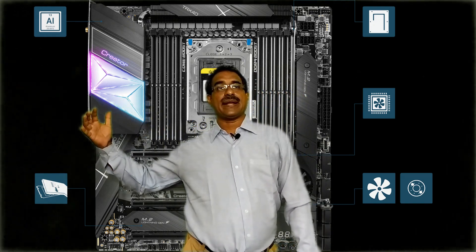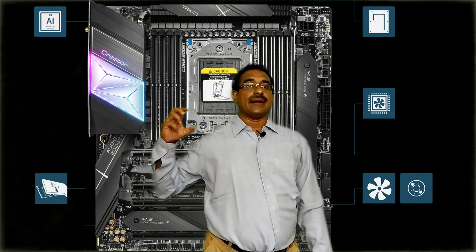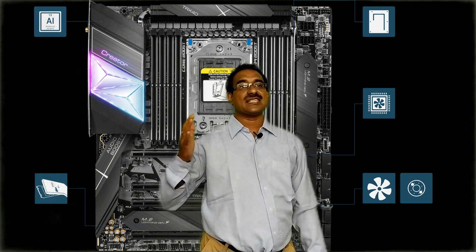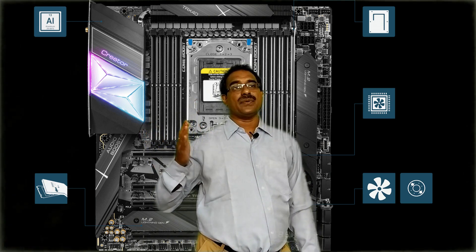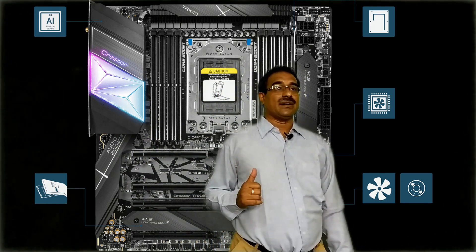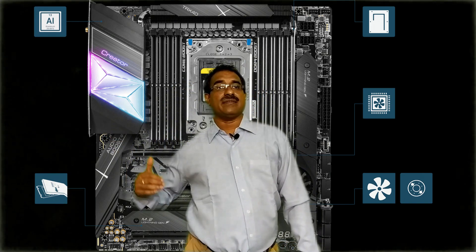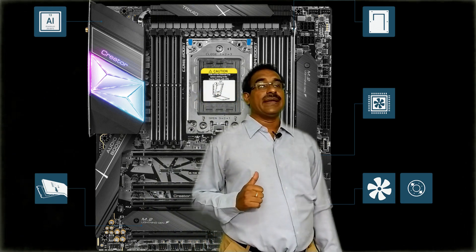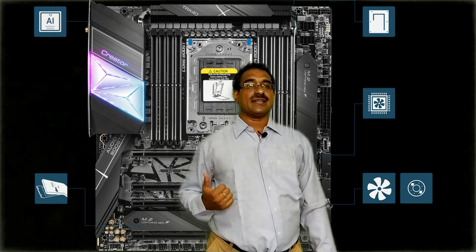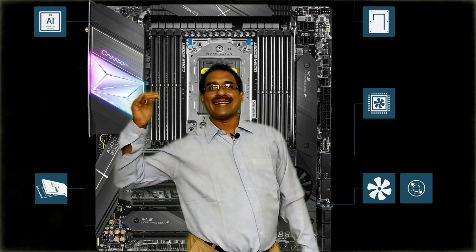The main specifications: CPU support is third-gen AMD Ryzen Threadripper desktop processors. Memory is quad-channel DDR4 with frequencies up to 4666 MHz. Onboard PCIe x16 slots support 3-way graphics cards and CrossFire. Audio is 7.1-channel HD audio with audio boost — four levels available. 32 GB/s M.2 supported, with 3x Lightning Gen 4 M.2 slots available. Six SATA slots are available at 6 Gb/s data transfer speed.